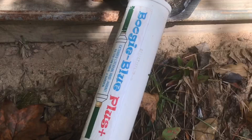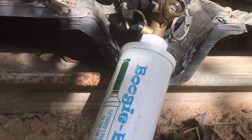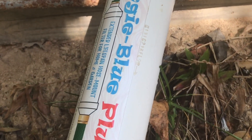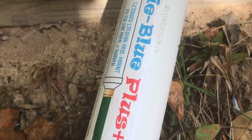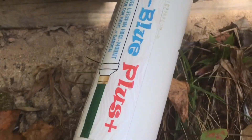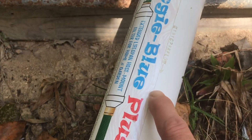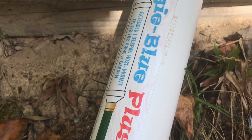Let's go check it out and see how it works up here at one of my IBC totes. This is a backup tote with chlorinated water in it — slam full, so you've got roughly four feet of water in there. The static PSI on this would be just a smidge under two PSI. If you're going to use this filter on a tote with a pump, don't put it on the suction side — there's too much restriction. Put it on the pressure side, the high-pressure discharge side of your pump. But let's see what it does with just gravity.